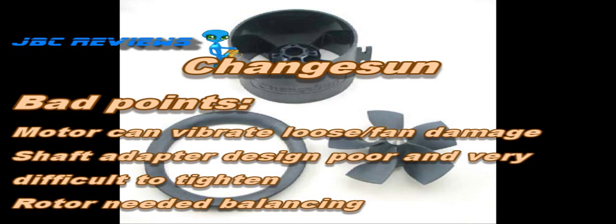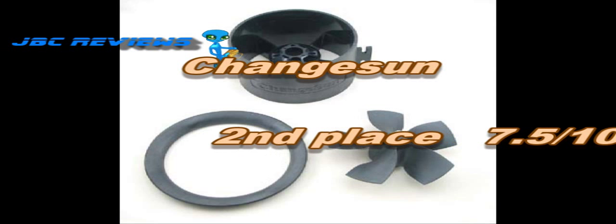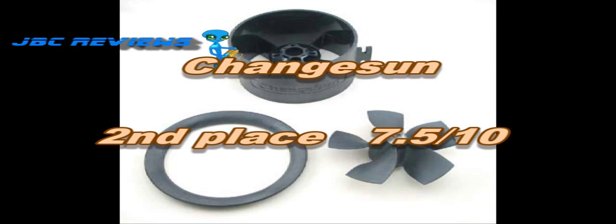Also, the fan that I got sent to me required quite a bit of work to get it to balance relatively smoothly. Now, saying all this, with all these things in consideration, I'd say the ChangeSun out of the three probably gets my vote for second, because it has got potential to get some pretty serious output out of it, but it's going to require a lot of work to get it to balance, to get the motor to not move in the housing, in its stator, and to get that shaft adapter to sit on nice and tight.